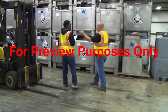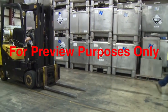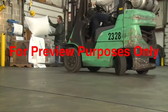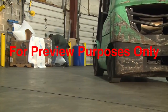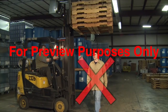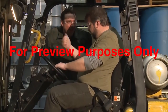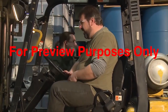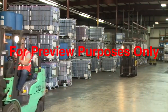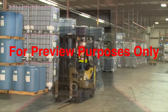Since they may not understand a forklift's potential hazards, it's up to you to remind pedestrians to keep their distance, even when the lift is stopped. Never drive your forklift up to a pedestrian who is standing in front of a bench, wall, or other fixed object. Don't let anyone walk under raised forks, whether they're loaded or not. Don't let coworkers ride on your forklift either, and never let anyone ride on the load. Stay at least 3 lengths behind other forklifts that are traveling in the same direction. Do not pass them at intersections or similar locations.